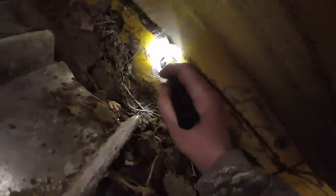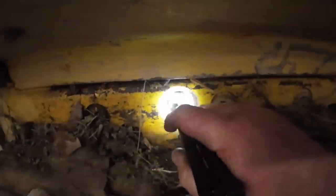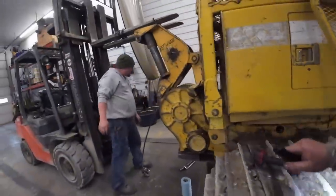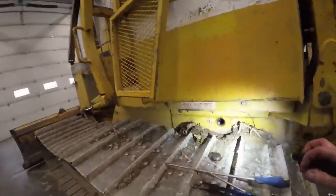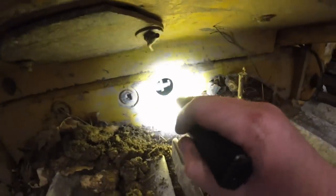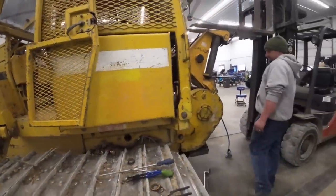It's kind of a little star wheel in there, like on a pickup truck drum brake adjuster. You can get these things running and take a screwdriver and crank that up. But this side has like a half inch of adjustment behind the nut — pretty fresh. This other side has got like an inch of thread showing, which tells me that brake band is worn, come apart, or something.